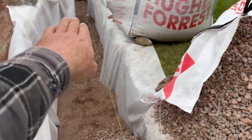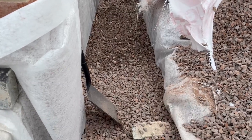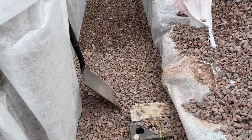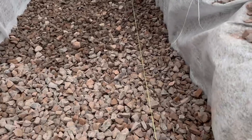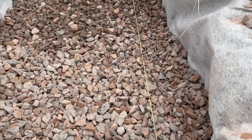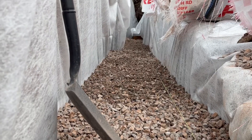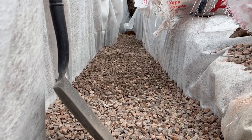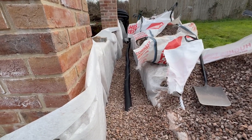Now I've just got to backfill up to that line by eye, form the gradient with the chip-ins, and then we'll put the pipe in. I did it with a string line really — I've got to make sure the string line is freely wobbling without getting caught and it's just hovering above. That looks pretty nice and flat and level, so it's time to put the pipe in.